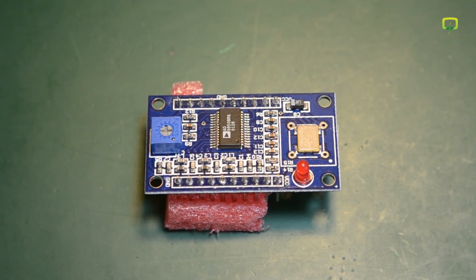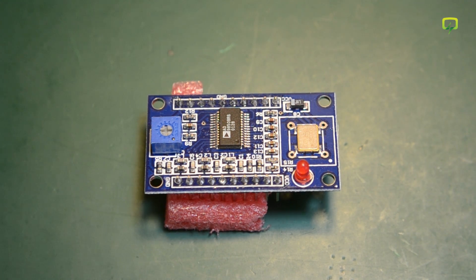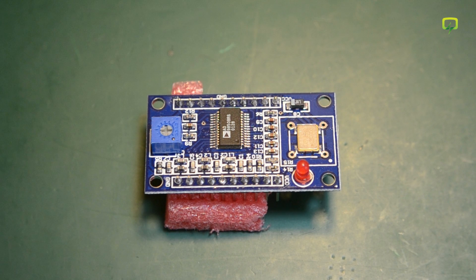The chip has a digital interface that you connect to your microcontroller and through that you can control its operation. I plan on creating a small signal generator using this module and possibly upgrading its crystal oscillator to a better one. However I still have to figure out some output buffering and the way of controlling the output voltage level. Basically just one of the many projects I have on my to-do list.